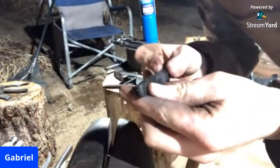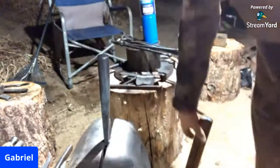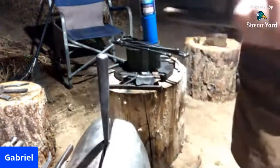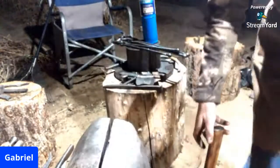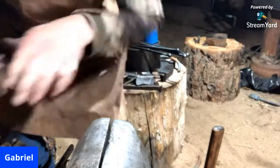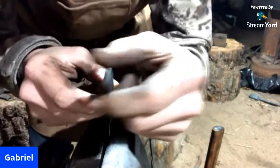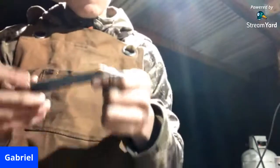And as you can see, I wasn't hitting it super hard because I'm not trying to break it. But we even get on the tip there a little bit more. And it just popped out of the vise, but did not break. I'll prove that it did not break because the tip is not shiny. See, the tip is still dull. No fresh metal there. So this has been a successful forging of a little square punch that fits nicely into my half-inch rivet tongs.